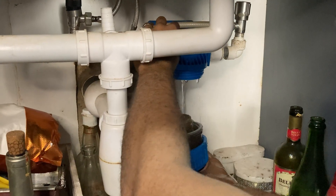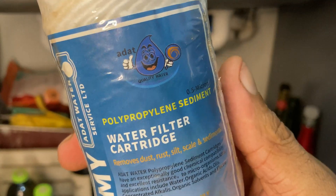Now that you know how to harvest rainwater, you need to keep the system clean. Your rain gutters should be cleaned out regularly — for us that's once or twice a year. You also need to keep your tank clean, as dirt can get in over time and things can start to grow in there. And you need to change the filters: the mosquito net you just wash and put back, while the yarn filters you have to replace — about twice a year.